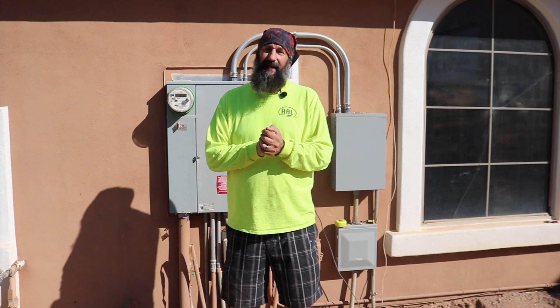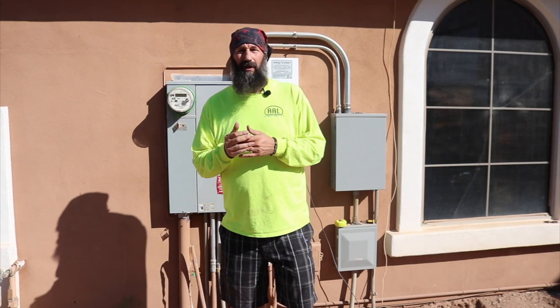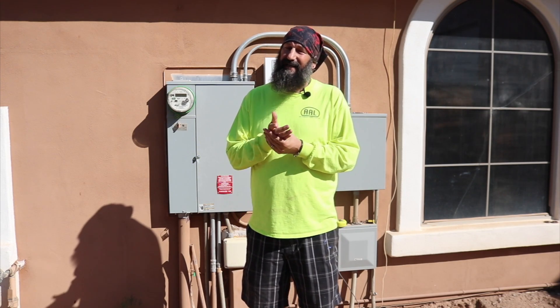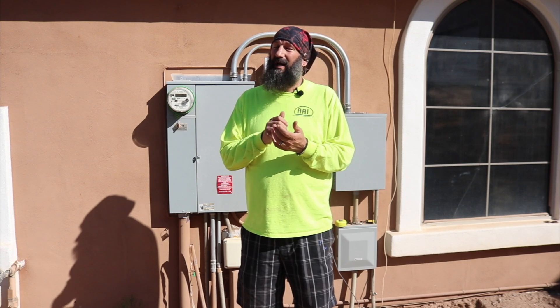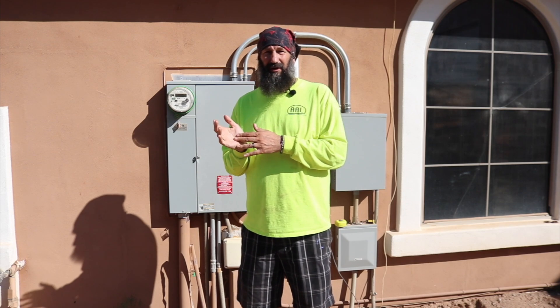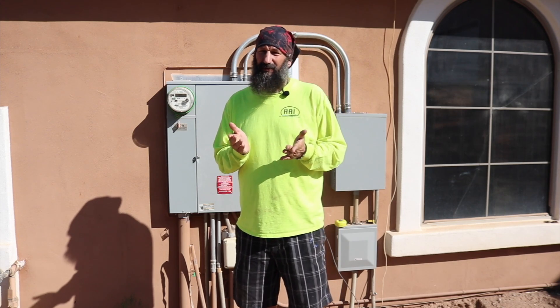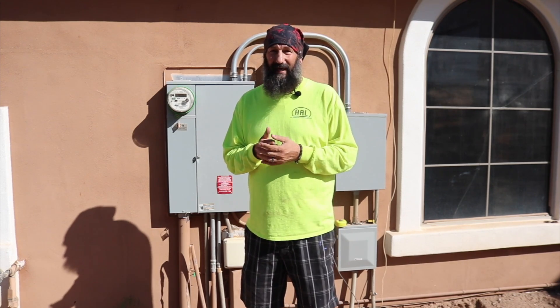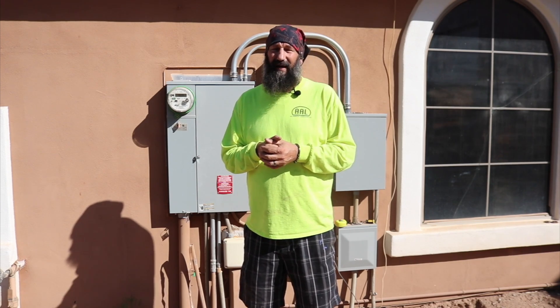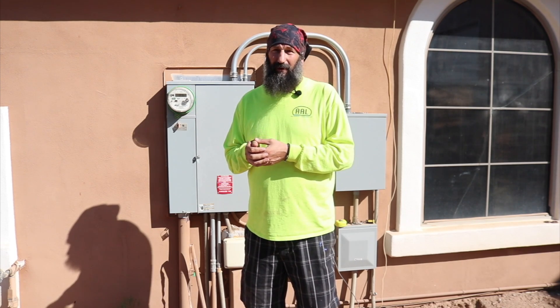Today what we're doing is we are going to be putting in an RV receptacle — a 50 amp receptacle that we are going to use for our RV on occasion, but what we're going to use it for every day is my wife just got a Tesla. We picked up a used Tesla earlier this week and we have no way to charge it. The cable that came with it, unfortunately the dealership since it was used gave us an old cable, the 110 charger. So it charges at about five miles per hour at its fastest rate. We need to get a 220 volt installed and we need to get a charging cable, because right now charging it on a 110 is just not working out for us.